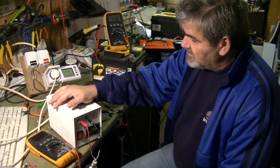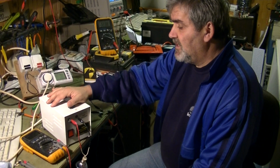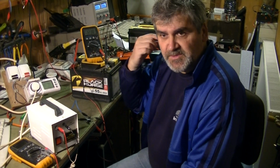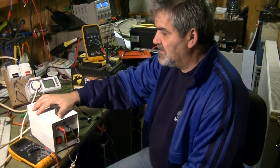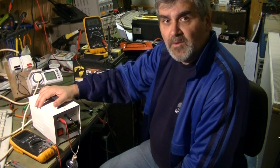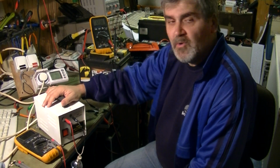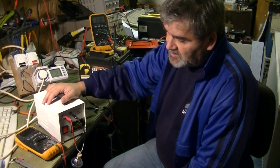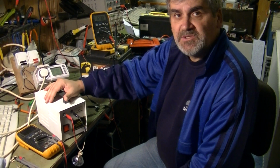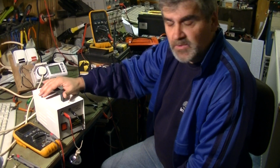First of all, I will have to remind everybody, or inform someone, that in electrochemistry joules, which means energy, are not very important. The number of coulombs, which means current, is more important than joules. In other words, for electrolyzers and batteries, it is not important how many joules you put in. It's important how many coulombs, how many amps you put in.